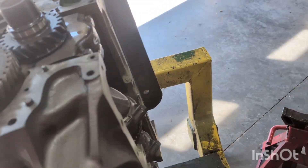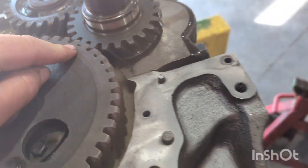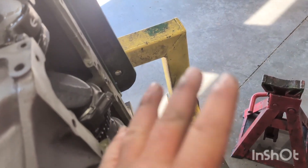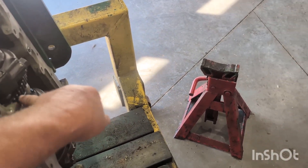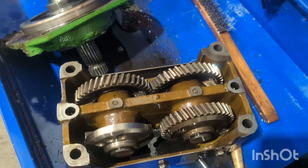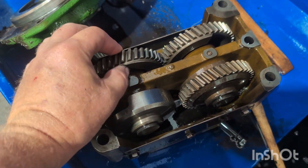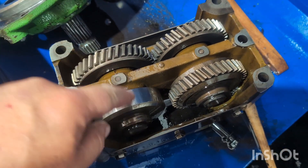Keys in the crank. We are timed — number one's at the top. We'll stand it up, get the balancer box put on, find the timing mark for that, and then get the oil pump on. There's your balancer box — since we're dealing with a four-cylinder they're not naturally balanced, so you can see all the weight on all four hubs.